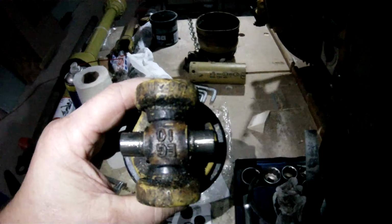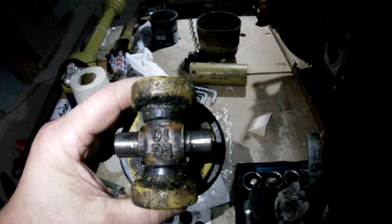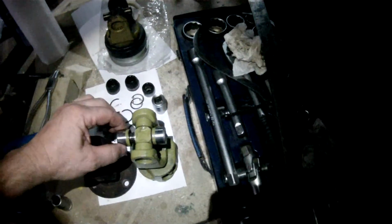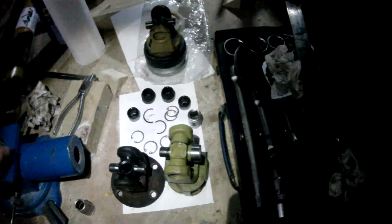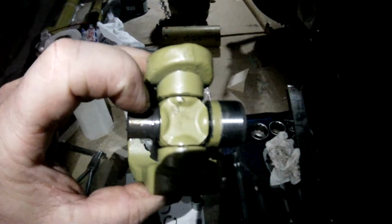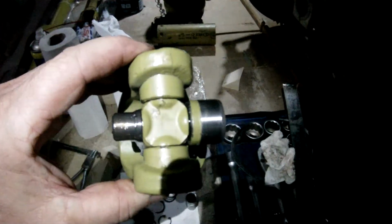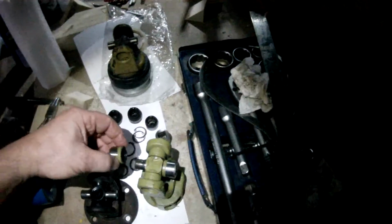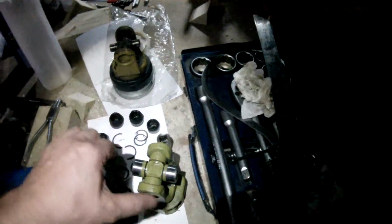On top of that, you'll notice variation in the agricultural units. So on this one, the two shafts are parallel right up to the centre face. But on this one, this is the new one, if I remove the bearing off there, hopefully you'll be able to see that right in the root, where I'm indicating in here, it's actually got a taper on it. Now, why they're different I don't know, because I had understood that this was part of the standard, but they are.